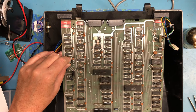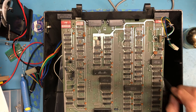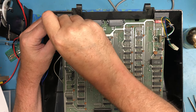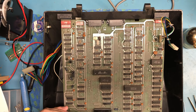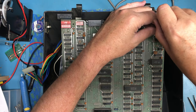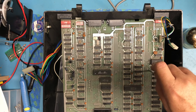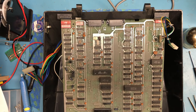I attempted earlier to remove the screws for the main logic board and the problem is this screw right here stripped. It was really tight and I worked and worked trying not to damage it and still managed to damage it. Several of these were in super tight the first time. I'm going to end up using the Dremel to cut a slot in that screw head and see if I can back it out, but I've tried getting on it with pliers and they just slide off.